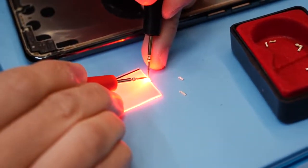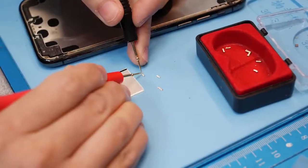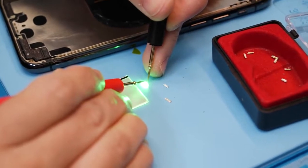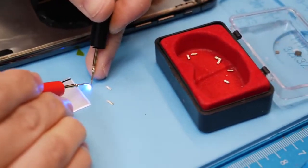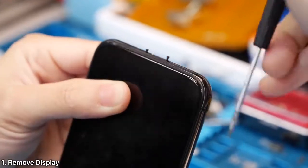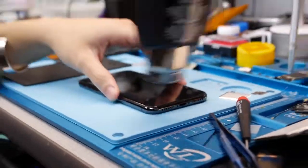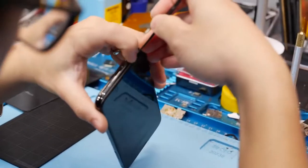If you try and power white LEDs with the iPhone X, it will not work with two, and if you try and power one it starts burning up because it's too much voltage. The sweet spot is using two colored LEDs — that way we can prevent our phone from burning up and still have a pretty cool effect. Blue is the weakest, red is definitely the brightest and most vivid, and green is a nice sweet spot in between. I'm going to try and break this down as simply as possible even though I know a fraction of a fraction of people watching will actually do this.